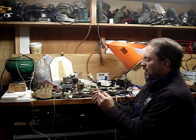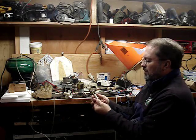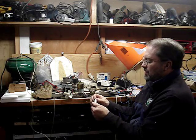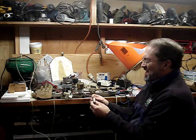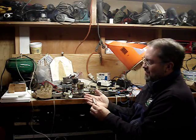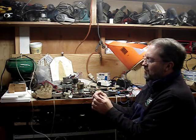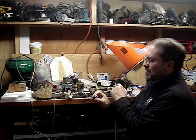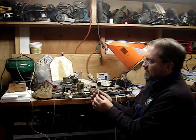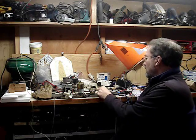I found a micro motor at a hobby store. This thing runs on 12 volts DC and turns real good, but the guy didn't know what RPM it was — it's unmarked. You can see how small it is; that small is one of my fingers. It would have been a real problem transitioning the drive shaft into the hopper, and it turns out it runs at 3,000 to 5,000 RPM, so that didn't work either.